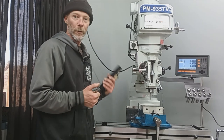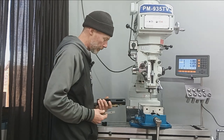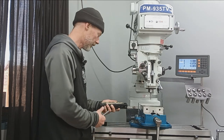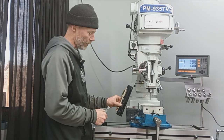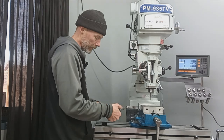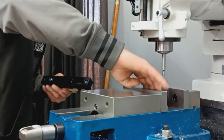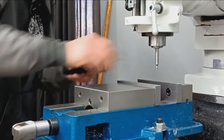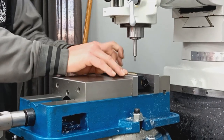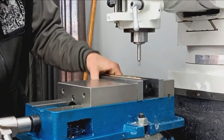Over here at our milling machine we've got a six inch vise, typical milling vise, it's kind of a Kurt style. We've got this nice block made by Precision Reflex — a nice machined aluminum block that holds Remington style receivers so you can do work like this. Since we've got one flat and one round, I'm going to use one parallel in the back just to hold the flat end of this jig. Slide it in and then gently come in and clamp the work piece.